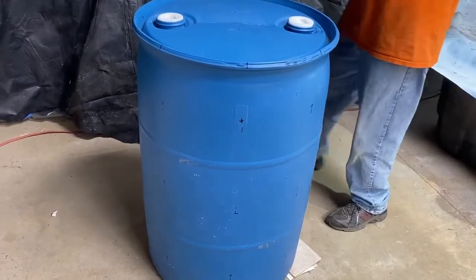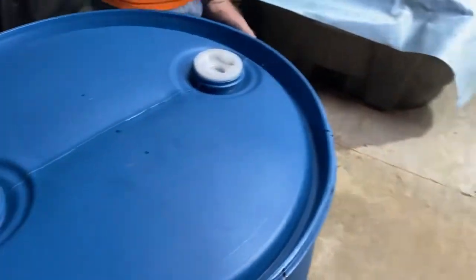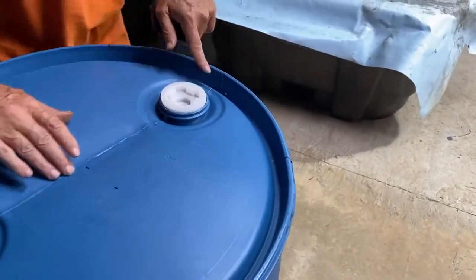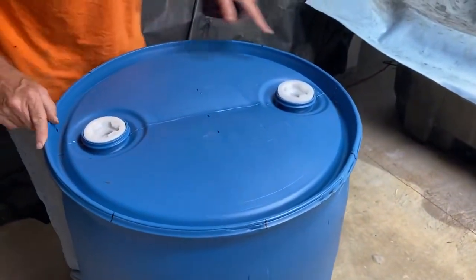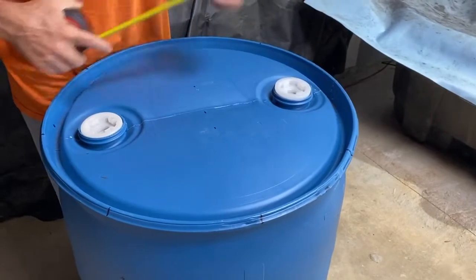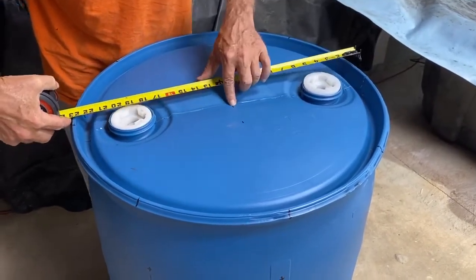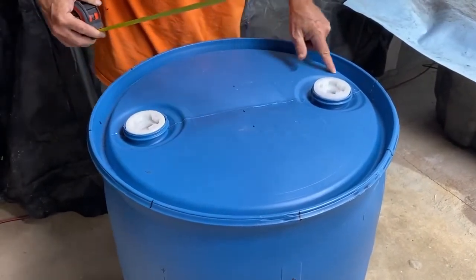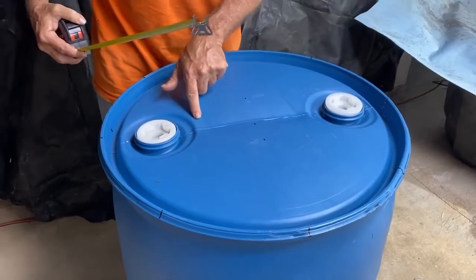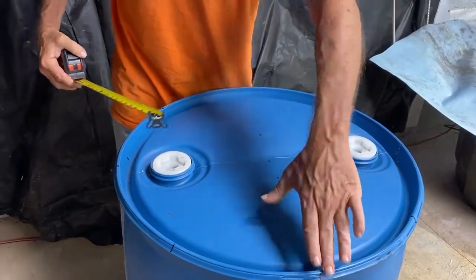If you come in a little bit closer, I'll show you that on the barrel it has a seam, and on the seam right here I marked this as the center — I use this to start my process. I measured across the top and it's 23 inches, then I found my center point and marked it. I used a square here to make sure it was center and that started my straight lines for my sides.